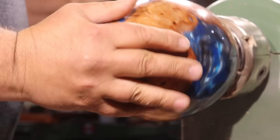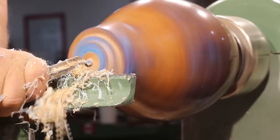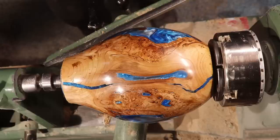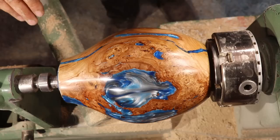I got this flipped around and put on the four-jaw chuck in the mortise and expansion mode, but of course I knew there was no chance this was ever going to run true after that. As I start to lay it up you'll see it is out of whack by a significant amount. So that means I have to redo the outside. I'm going to clean up the top here so my tailstock spur center can have clean wood to get into and not find its way into the existing off-center hole. The only significant damage is just inside this circle, but because it's not sitting center anymore I have to return and refinish the outside — I'll do that off camera.